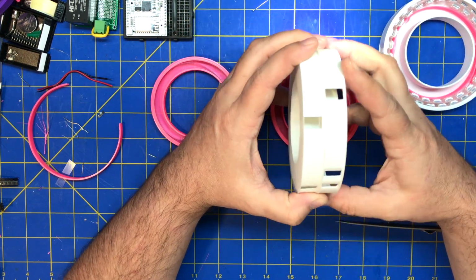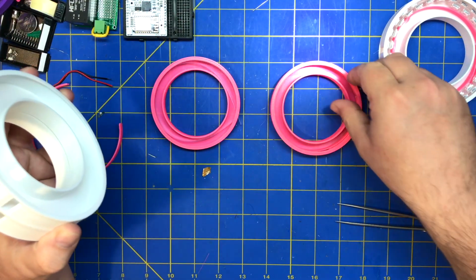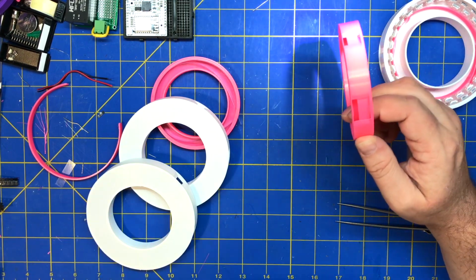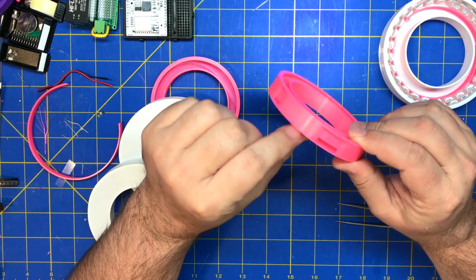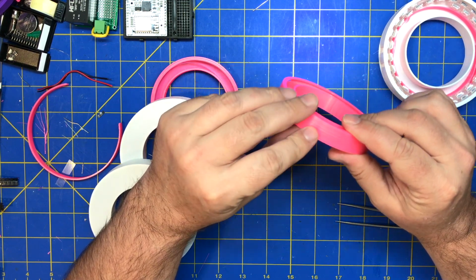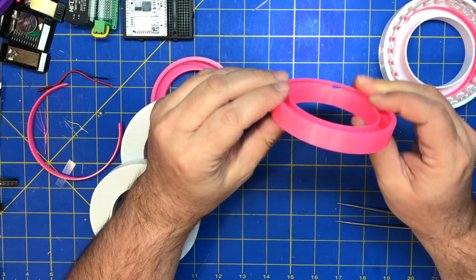It takes about an hour. It's on the higher end, but it reveals a lot of problems, such as this. One of these just broke right out. Let's see how bad that print is. Some layer heights print perfectly, some don't. I have to figure out how to calculate layer height. I mean, that should print at decent quality at all layer heights. So I think I have some kind of speed and retraction problem at certain layer heights. Most likely it's not the layer height that's changing, it's something else I'm changing. I'm going to try with a different slicer too.